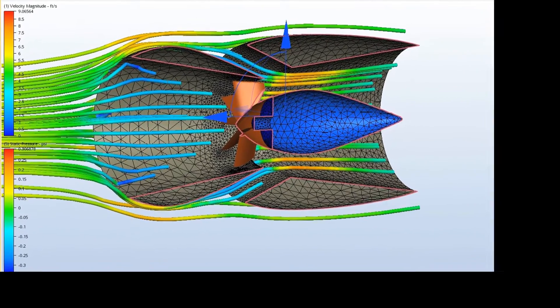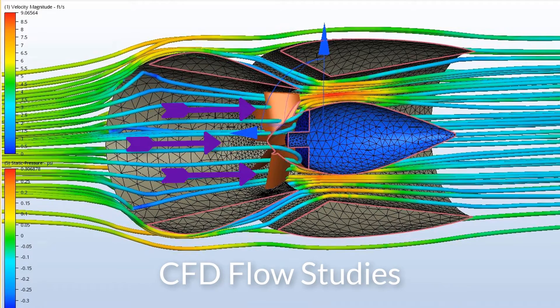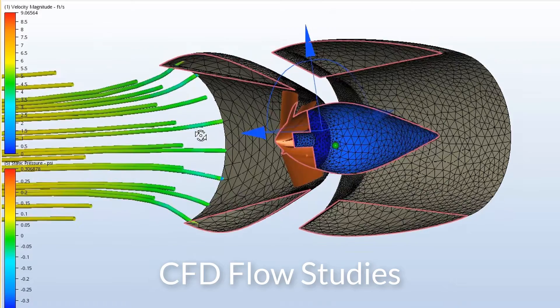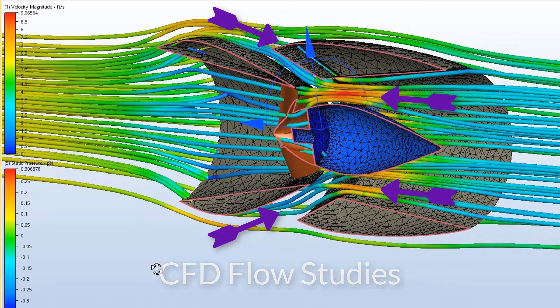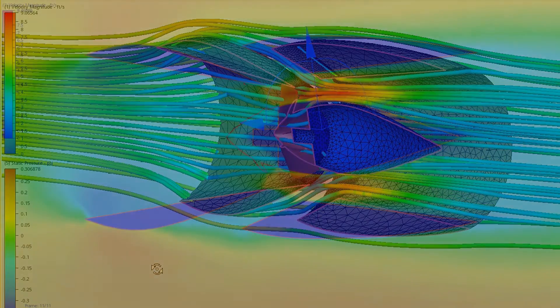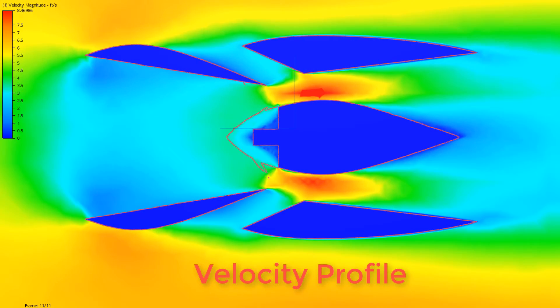Let's look at this in more detail. In the funnel, we have a high pressure zone as water stacks onto the propeller. At the same time, the duct is gathering side flow and bouncing it off of the internal wing. This creates a rotary suction seal just underneath the propeller, and this greatly enhances the torque on the generator.